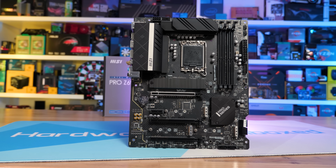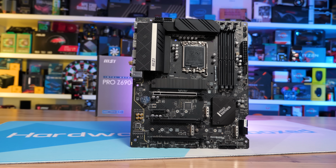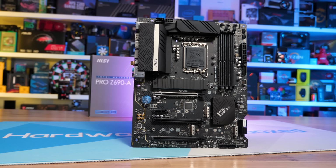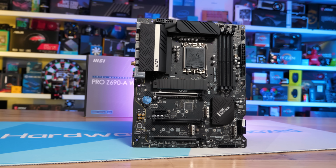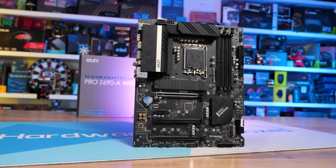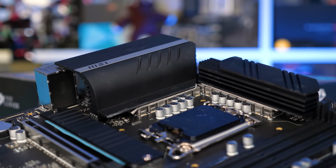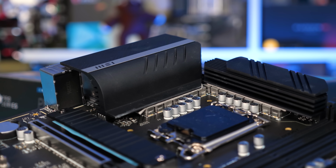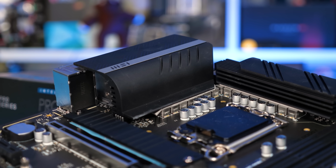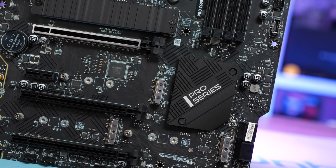Now, the MSI Z690 lineup is by far the most coherent, and therefore, in my opinion, most consumer-friendly. At the bottom of the stack is the Z690-A Pro Wi-Fi DDR4 for $220 US, and this board can be purchased with or without Wi-Fi support, and either option is available in a DDR4 or DDR5 variant. So there's something there for everyone, and it means there are 4 variants in total. The good news being that all 4 feature the same 14 power stage V-Core VRM using Alpha and Omega AOZ5016QI 55-amp power stages.